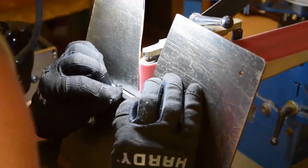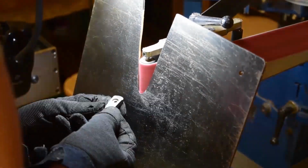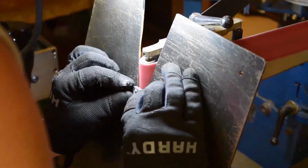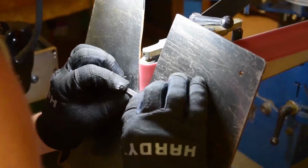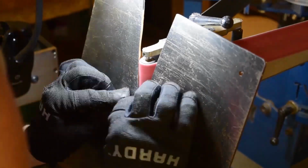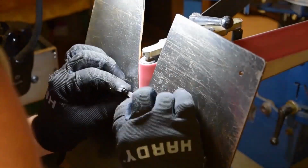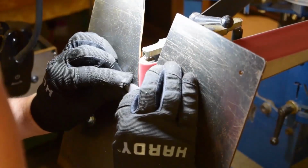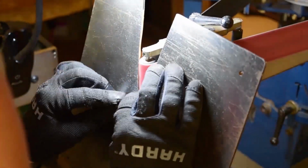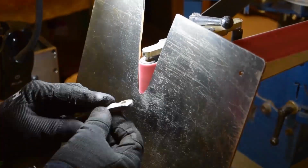On these little tiny grinds that I'm doing here, just trying to really kiss the material, make sure it stays in the right spot. I do have a 1/4 inch, I believe it's a 1/4 inch, maybe a 3/8 small wheel. That would probably have worked better, but the bearings on them, I've gone through 3 of them really quickly. If you put any pressure, like right now I'm putting a little bit of pressure on the small wheel itself, on the 3/8 or 1/4 inch ones that I have, any amount of pressure just makes the bearings go out, and they just don't work very well.